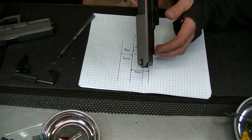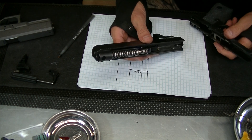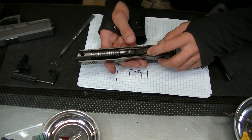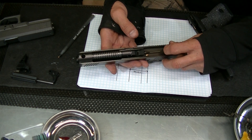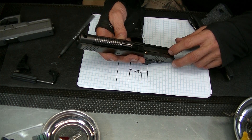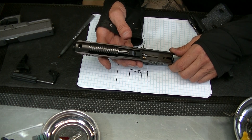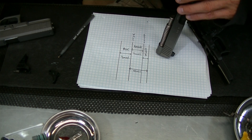I'm going to pop this open. Right away you can see there is a TIN-coated safety plunger, which is usually Zev Tech. When I look at the striker I can see it's definitely a Zev Tech piece just by the way they do the tails on their strikers. This is probably going to be a skeletonized lightened striker — I can kind of tell by the markings. We'll open it up to verify.